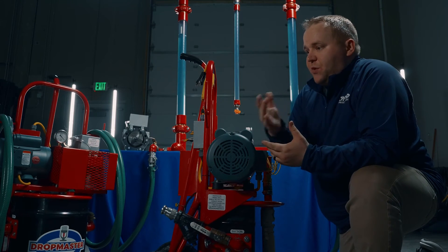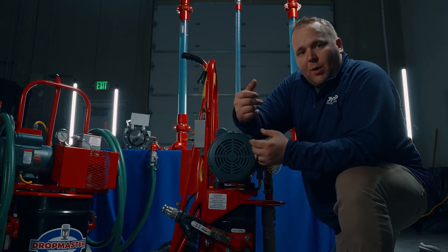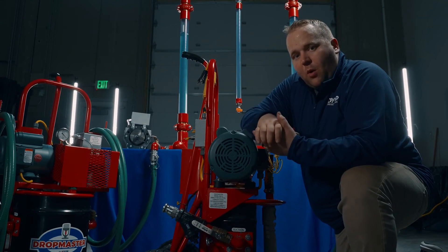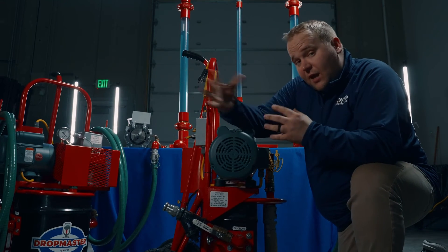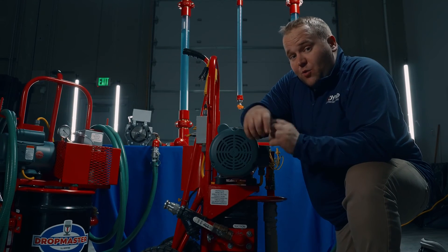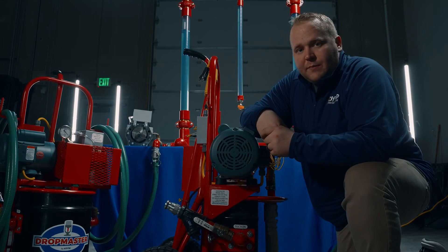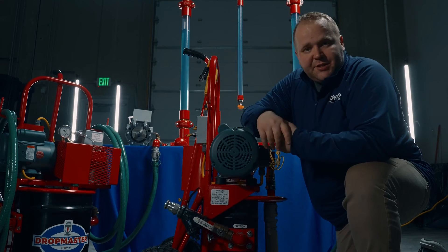As far as poor suction at the sprinkler itself where you're getting some water — remember, the longer the drop, you might have to go a bit slower and rock it a bit more before pulling it. Don't just pull it right off — you do kind of have to rock it. It's the airflow going by that's going to bring that water with it. It can do 10-foot drops all day long, but for 20-foot drops, you've got to go really slow — that is a lot of water. The longer drops have limitations to any device.